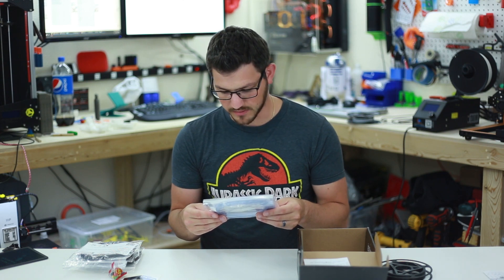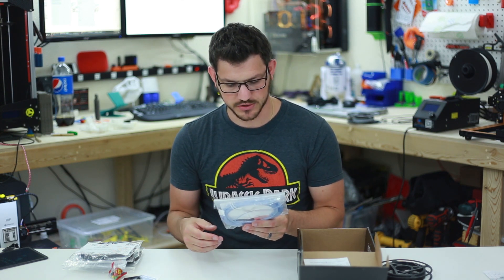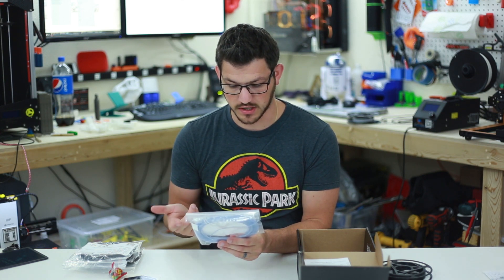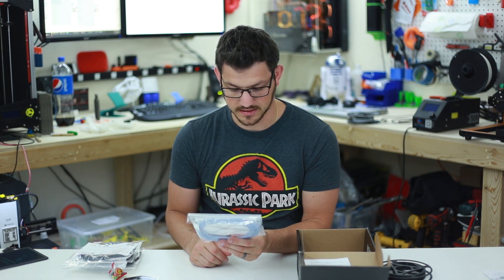Here we have Mold Lay from Lay Filaments, with the discount code for Filaments.ca. Hot end temperature 170 to 210, no heated bed needed, speed 20 to 50. It is not abrasive. It is great for making metal castings — heat up to 270°C to melt out the wax and start your investment casting. Prints best under cold conditions with cooling.